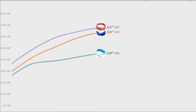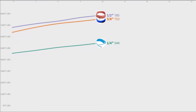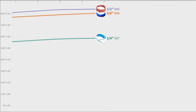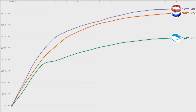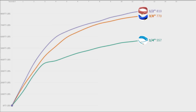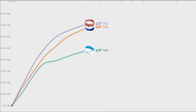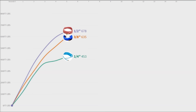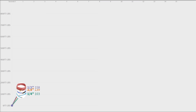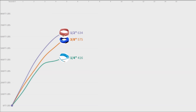For the three-eighths and half-inch air hose, it does appear to be a different story — they both can supply the impact wrench adequately. At two, three, four, five seconds, the half-inch airline is making 60, 65, 70 foot-pounds more than the three-eighths. But up to 15 seconds, at what is probably a reliable level of airflow for the impact wrench versus the airline, the half-inch ends up making 840 versus the three-eighths' 805 — that's around a 5% difference. Not as significant as we were expecting.